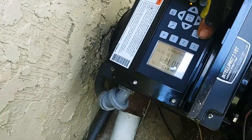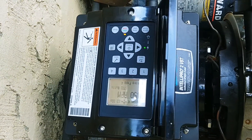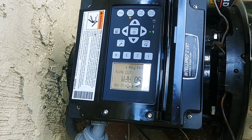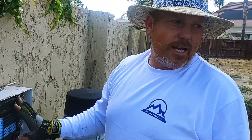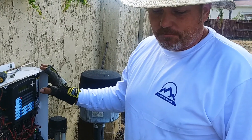Program number four is on. We want that to be 3,450 all the way up, and then we can save that. But it's up to you what speed you want for which relay — you have up to four, and you don't have to use all of them. Now that we're all set up, I can schedule everything at the control panel. I don't have to schedule anything here — you can shut this. I'll leave some links in the description so you can see where to buy most of the stuff and the brands I'm using. If you have any questions, feel free to leave a comment. Have a good day and thanks for watching.